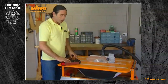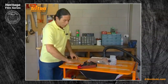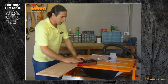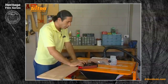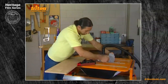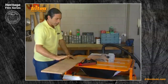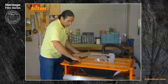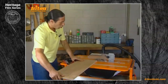When would you use the protractor as a leading edge or trailing edge protractor? With the work held against the sandpaper face, this is called a leading edge protractor because the protractor goes first. You'd use this when cutting a fairly wide board. If you tried to cut a board of this width with it as a trailing edge protractor, the board just won't fit in.